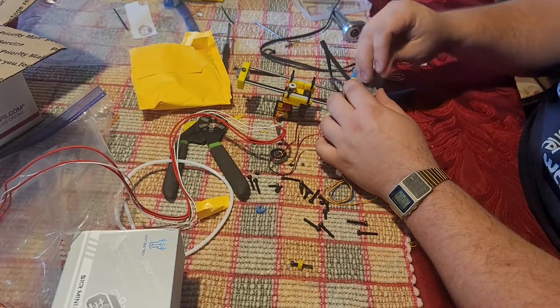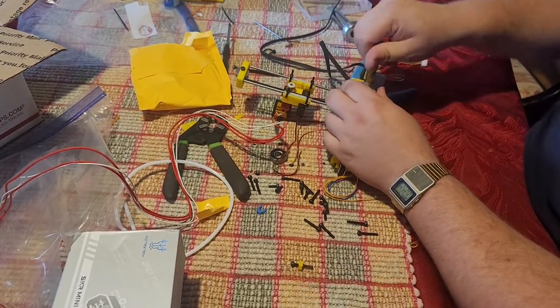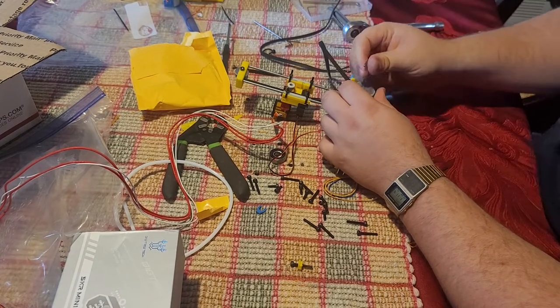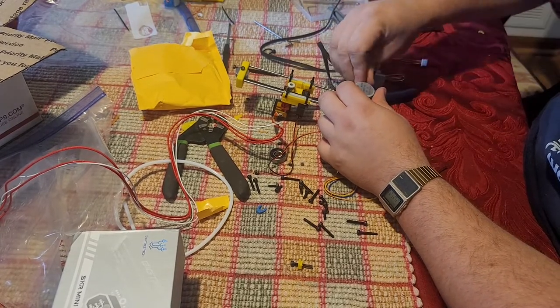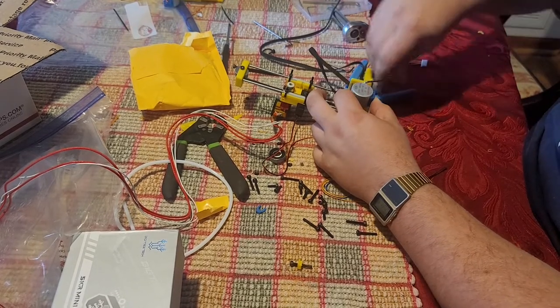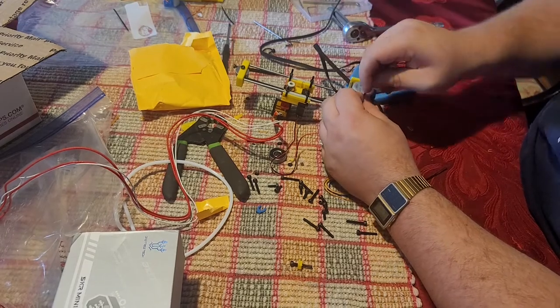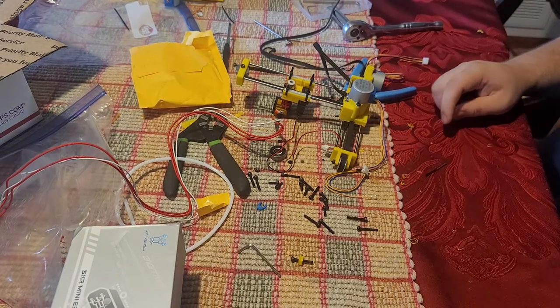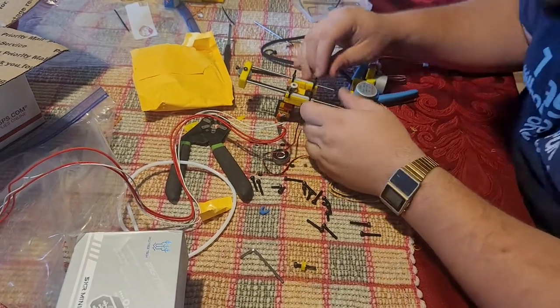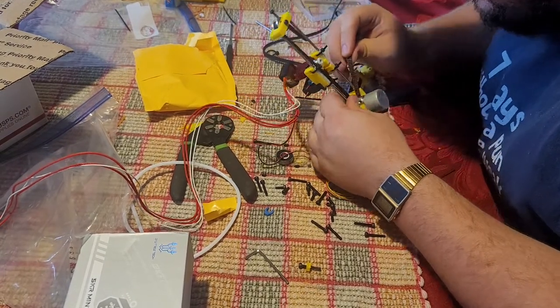As a note, I'm planning on making a fan duct to go in between the fan and the hot end to keep things a little cooler. Because I noticed at IRF and the high humidity, high heat environment, if I printed for more than about 4 hours, I started to get some bad heat creep. All right, so now that's in. There we go.